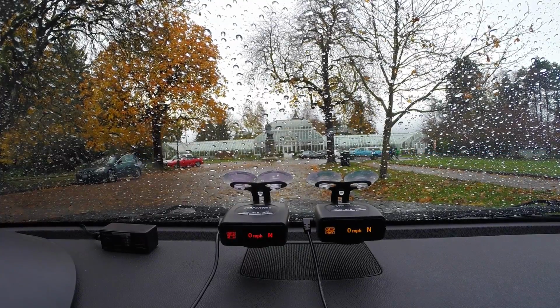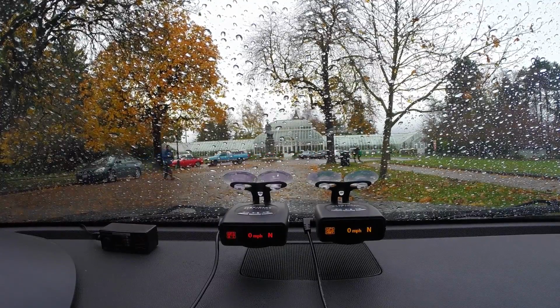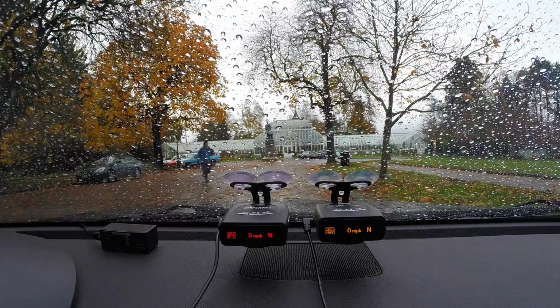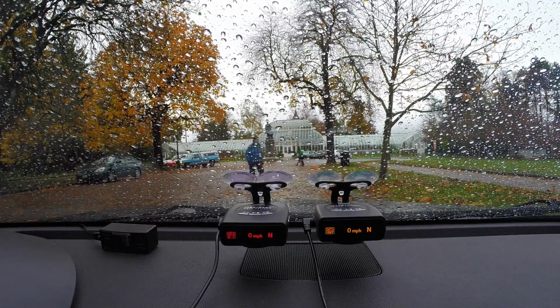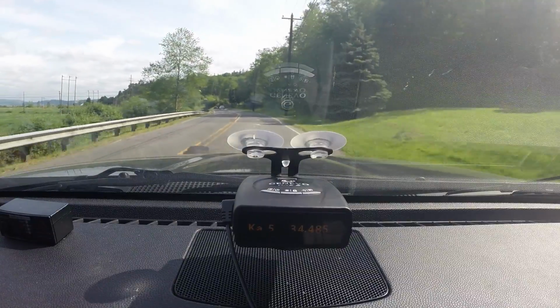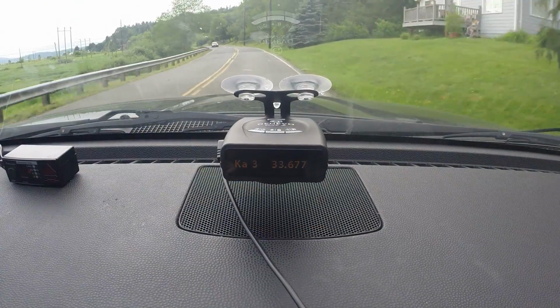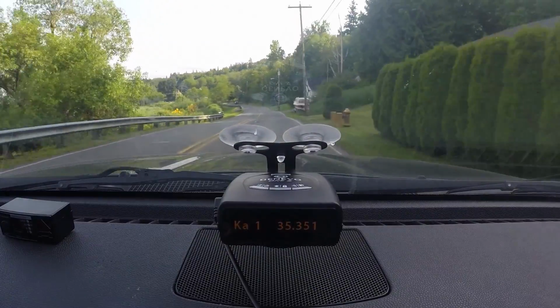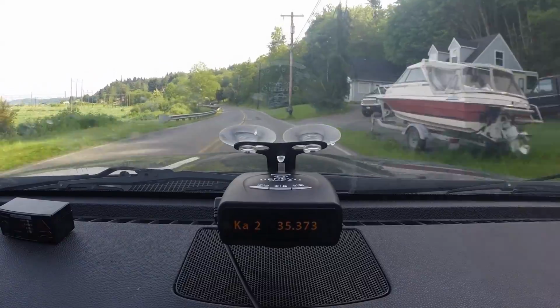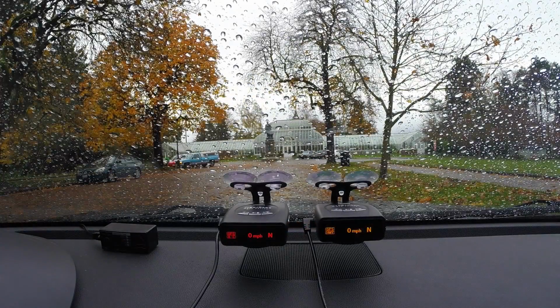Radenso currently has an issue with displaying accurate frequencies. And what I mean is it can't do that. This has been an issue since the very beginning. What we were finding is it was misrepresenting and misreporting the actual frequencies. So 34.7 was like 34.3, 34.4, 34.5, 34.6. Like it was sometimes a couple hundred megahertz too low. Same thing with 33.8 would be like 33.6-ish. 35.5 would be like 35.3. It was just misrepresenting everything quite a bit, and it wasn't a fixed amount, so you can't just fake it and bump it up. So the frequencies are being reported incorrectly.